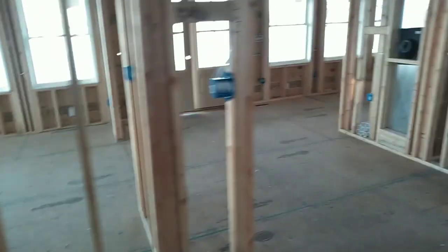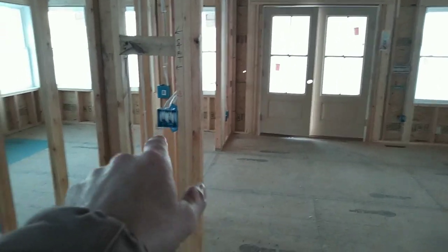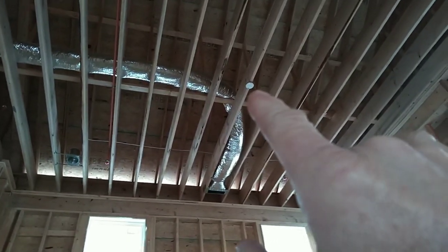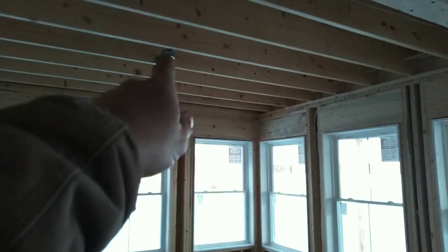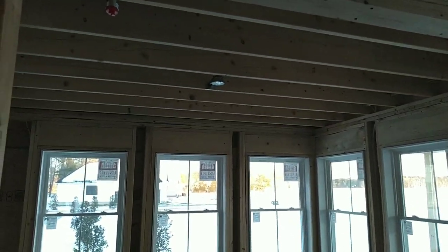Coming through the front door, I try to keep my switches separate — right side and left side. This side pertains to this room so it's less confusing. The first switches you come to control four ceiling cans: one, two, three, four — that lights the perimeter. The other switch at this box is going to be for a remote control fan-light combo. And this switch is for the office area. Every box I use in a room is a fan-rated box so the customer can always install a fan later.